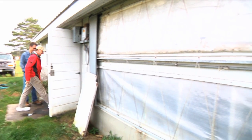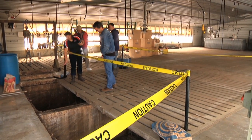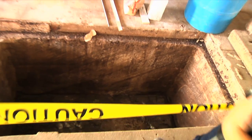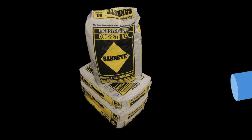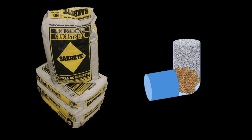To minimize cost at our lagoon, pipes at Haskell Ag Lab were left in place with the inlet broken off about five feet back from the original berm. Access points in each building were plugged with concrete. To minimize waste, mix cement thick enough that it stays near the access point. Due to the size and slope of some pipes, using wadded paper or some other material to prevent movement of the concrete before curing may be necessary.